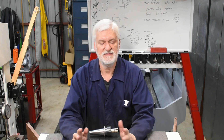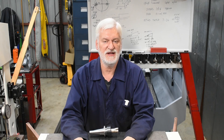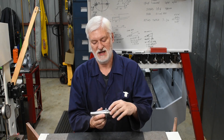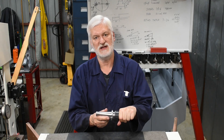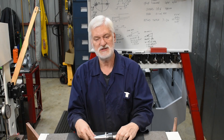I want to pay tribute and say thanks to the YouTube viewers and subscribers who offered their advice and experience on how I could address the problem. It was very much appreciated. In particular I want to say thanks to Bad Juju — his suggestion was the one I ultimately used to fix the problem. He pointed out that the main reason I was having a problem was that I had done the two tapers independently, so it's not surprising they didn't quite line up. His suggestion was to do the first taper — the ER40 — and then put that in the lathe and use it as the reference point for doing the second taper, which is what you saw me do with the corrective action. With that approach I've got a very good result.